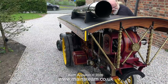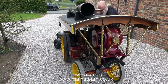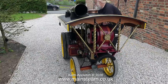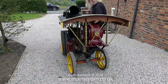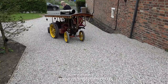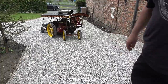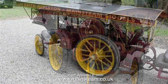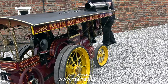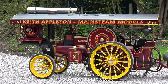My neighbour's car out on the road is not in a good place at the moment, but I've got used to driving in and out without hitting any cars on the road. On the steepest part of the hill the traction engine really was trying to roll down even in gear, as you can see here. This wouldn't have happened had I put the traction engine in the low gear, but that really would have taken a long time. So it's a calculated risk — it can't run away because it's in gear anyway, and it would just slowly go chug chug chug down the hill.